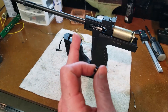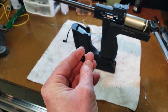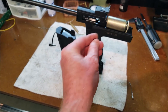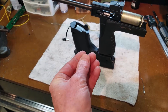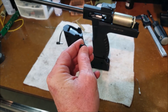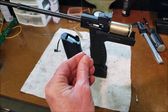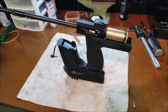It squeezes that flat. As the hook engages on the groove, it brings the valve body closer and closer. What can happen is if you don't have silicone oil or silicone grease on the face of your valve body — the part that slides up against it — it can roll the seal out. I was thinking that might have actually happened, but that's not what happened — it was just the way he was trying to get it in.